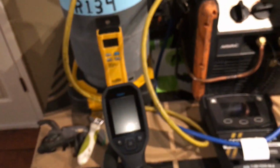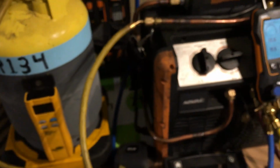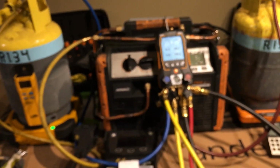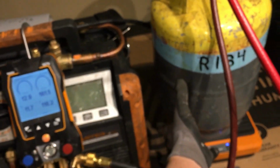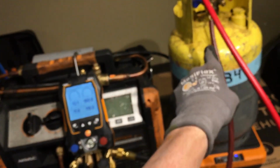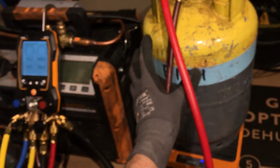And I think that's good enough to make a real fast example and a demo of the pressure and temperature relationship. Now, what would have happened if this was an empty tank and I didn't have 20 pounds of cold refrigerant inside the system, and I was pumping 140 degree refrigerant into an empty tank? Because there's no mass, only the steel shell, and it's empty, and say it was 60 degrees, it would rapidly heat.